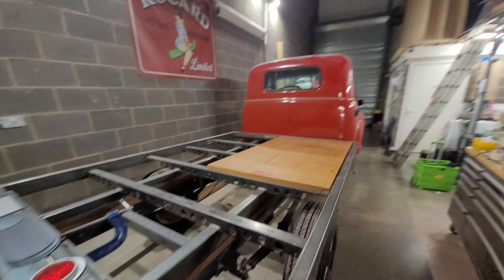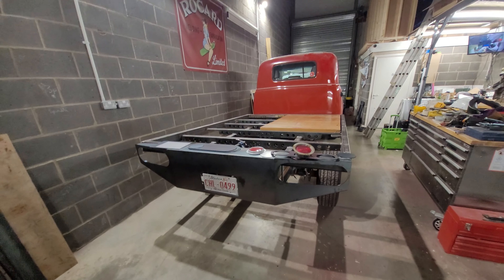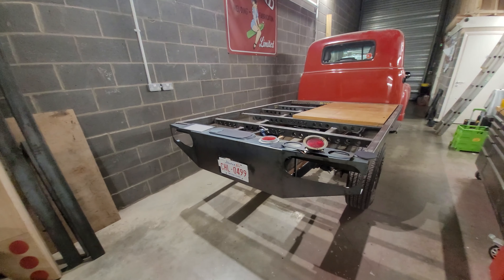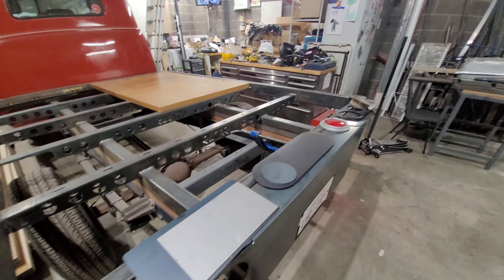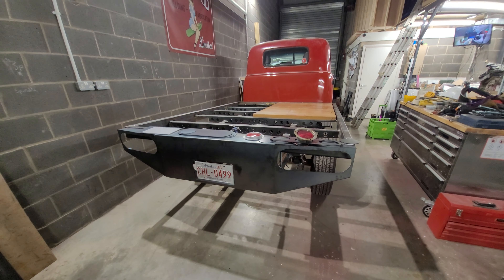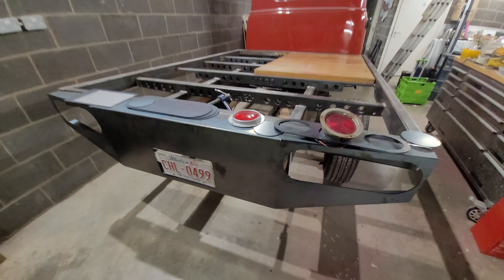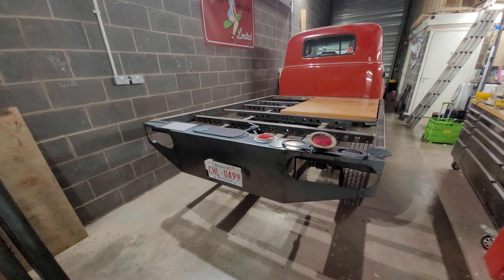Look - the wooden template, the pattern, has been turned into a piece of folded metal. I've started to bring my lights and reflectors in to test out how it's going to look. I'm pretty happy with it. It's always worrying when you do some measuring up and it's going to cost a fortune to have laser cut and folded - you're hoping it's going to be exactly right. It's three millimeter thick steel. I've done the drawing for it and there's quite a lot of structure remaining to be done on it, but sometimes it's good to let things develop.